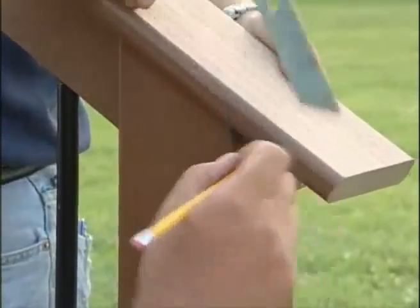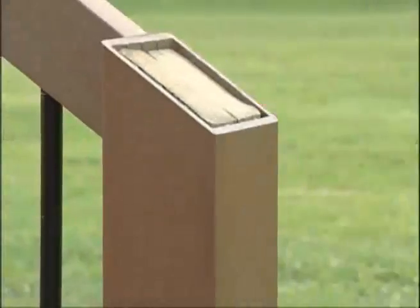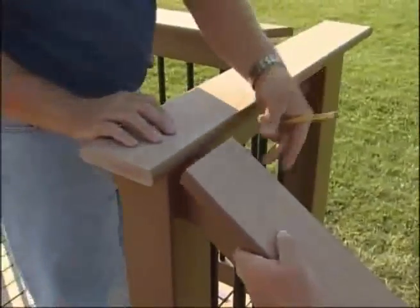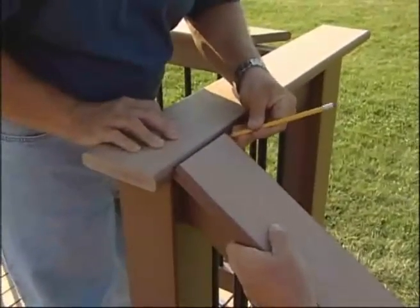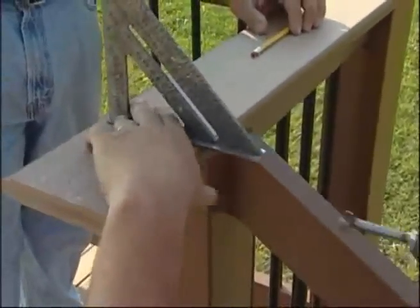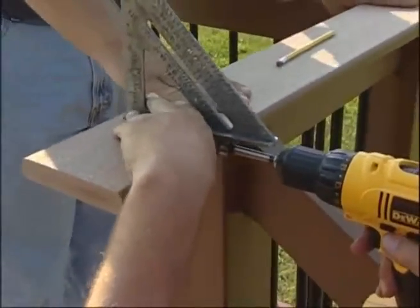Measure down the rail assembly and over the bottom post. The plank should cover the bottom post completely. To create a clean transition at the top post, place your stair rail top plank against the plank that will be top rail along the deck. If you are using our traditional 5/4 plank with the radius edges, it will be necessary to use a 3/4-inch Forstner bit as shown.